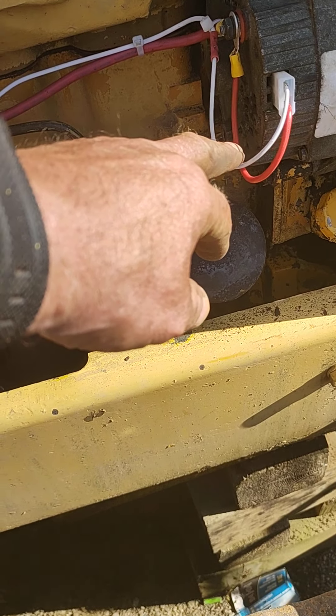We've got a loose plate — we don't want that, because if a rock gets in there and it's just about flipping over, you start doing a turn and you're going to bend everything. The rails are shot and we're going to get new rails. Picked up some number 8s, half by inch and a quarter. We're going to torch-cut these out. I don't know who put this in, but they're just dangling — oversized, wrong bolt. We're going to do it right, do it once.